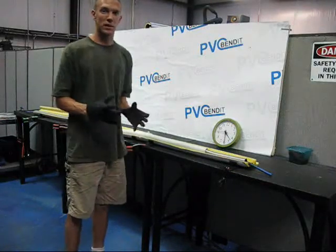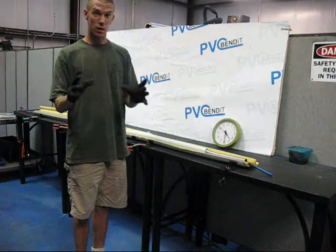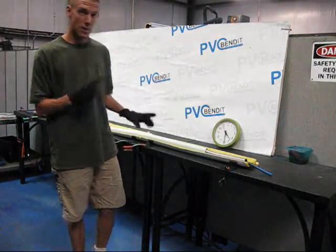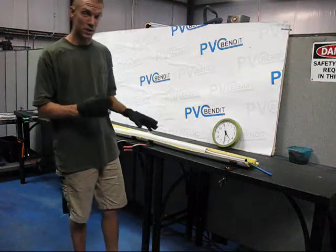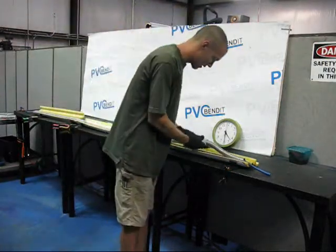It is so important that we will repeat this every time. Put your gloves on before you take the pipe off the bender. That thing is hot, and right now it will burn you if you touch it with bare hands. So be careful about that.